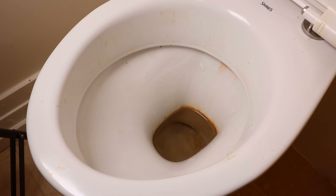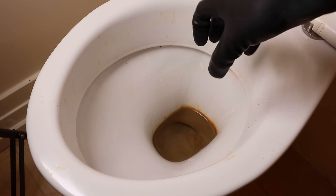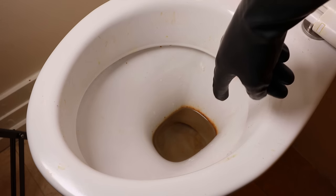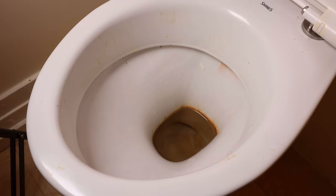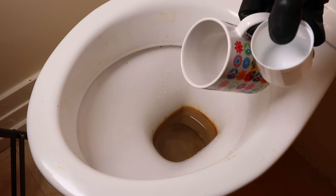The first thing we're actually going to do is get as much of this water out of here as possible. If you have either a plunger or toilet brush, push it through into the back pipework as much as possible. You have two options really — you can soak it out with a wet vac, which I'm about to do, or use something like these to scoop it out.